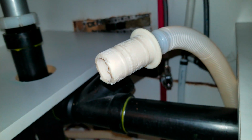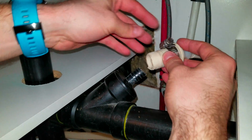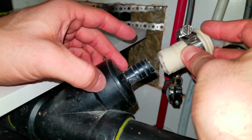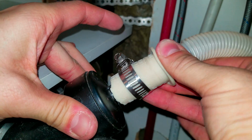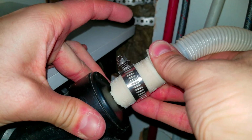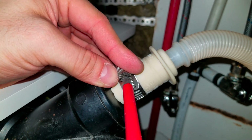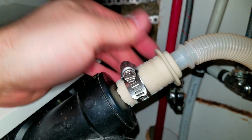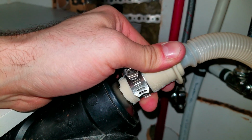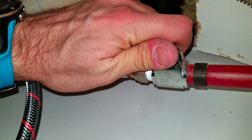And now, we have our other pipe. Install a crimping collar on it. Then, insert it on the sink piping. This is the input. You should have something looking like this. I hope so. Crimp it really hard. If this falls, all of the dirty water of the dishwasher will finish under your sink. You can now open the valve.